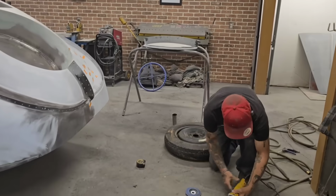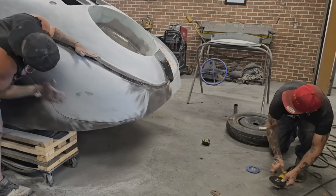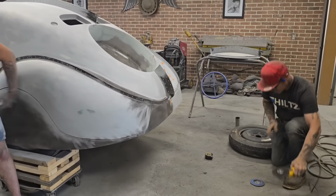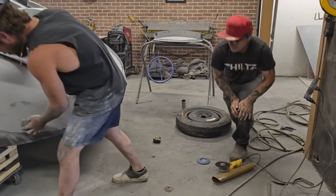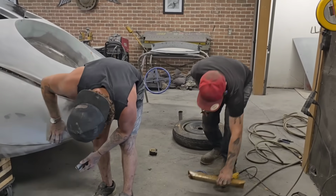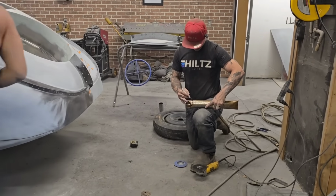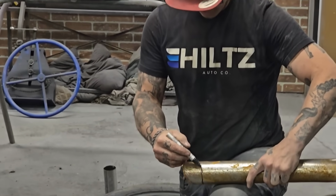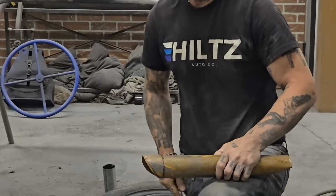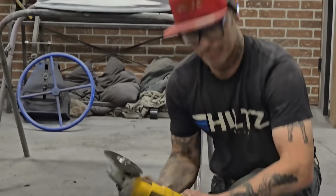As soon as Colton gets all that guide coat off that he put on there, gets it blocked out where it is, he's going to be going back over it to try to fix more pinholes. This time, I'm thinking it's going to be a lot more delicate than putting filler in the pinhole and sanding it off. I think we'll send him around the car with a paintbrush and some primer with some hardener in it. That way we just maybe pinhole it with primer itself. And we'll film that. Jolene will film that and show you exactly, so if you don't understand what I'm saying. Not everybody understands at the same time as everybody else. Some people need to be repeated and some people don't. I'm one of them guys that need to repeat everything to me.